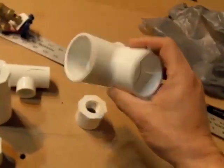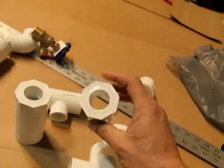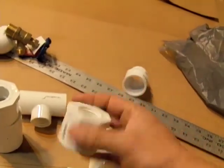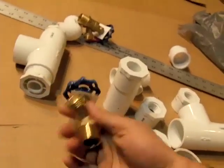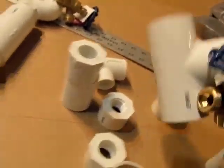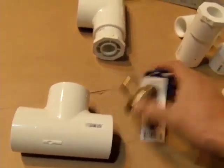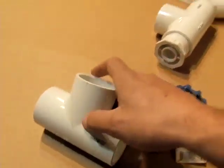For this project you're going to need a one and a half inch T, one and a half inch to three quarter inch reducers or adapters, two for the ends, and one more with threading. I'm using a regular spigot valve here to draw the vacuum out and then close it. You don't have to do the T — you can tap a hole inside of the one and a half inch pipe, put a ball check valve, draw a vacuum, and then close it. But this is easier, and it's a couple bucks more, plus this way you can see down inside.